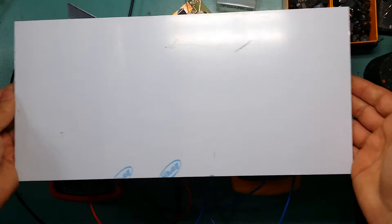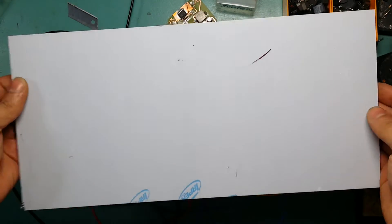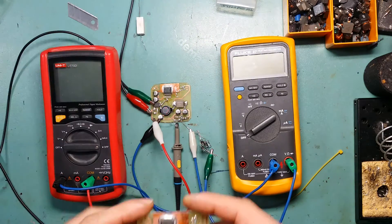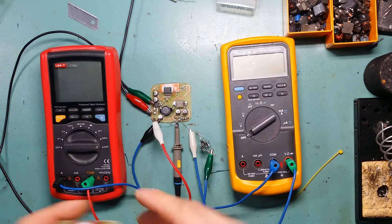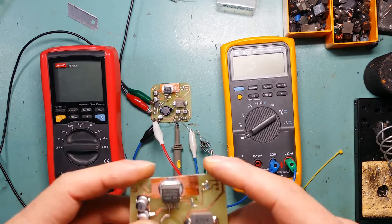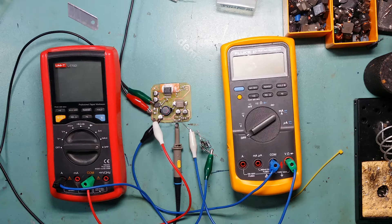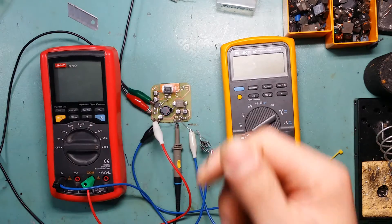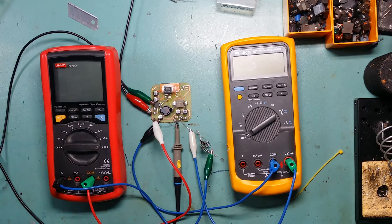I want to run this from five volts to get the full speed. As it's a platform I'll put on my desk and work on, I don't want it to be bulky or heavy. So I decided to use a DC-DC step-down converter for the power supply. You can get DC-DC converters on eBay really cheap — about a couple of bucks — but the problem is they're very noisy on the output. Once you start pulling a little bit of current, the ripple goes really high and that noise isn't good for running microcontrollers, op-amps, and similar components.